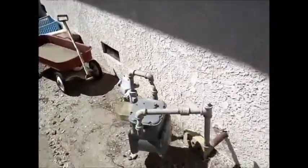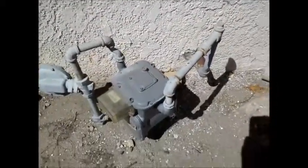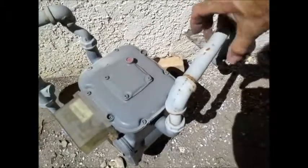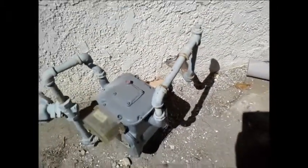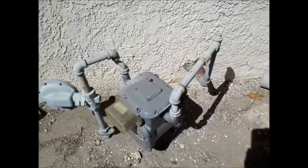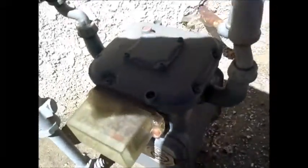Then on the right exterior of the house, we find your gas meter. Since 1996, it's required to have a seismic gas shutoff valve. They'll put it on this side. It's usually a red or blue box. It's at the time of sale when they'll put them on. It tells us that this house has not been sold in many years.